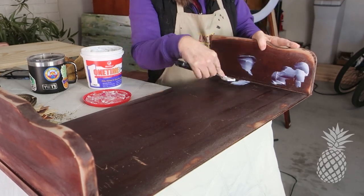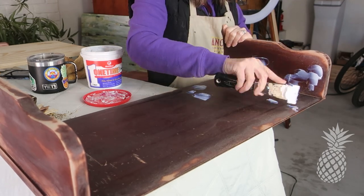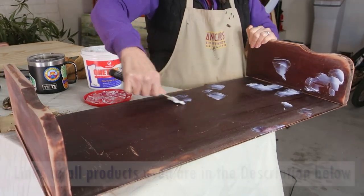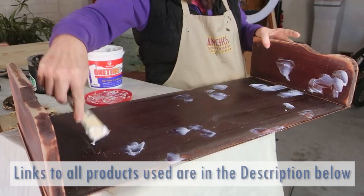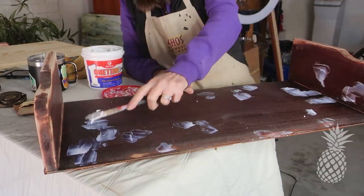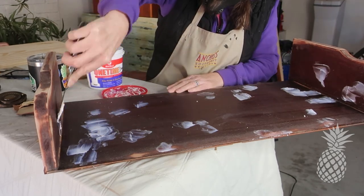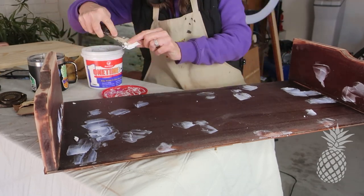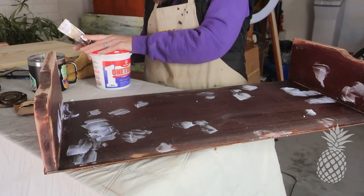You know, over the last two projects, we've discovered lightweight spackle. I'm not sure what brand this is, but it will be linked down in the description below. We just love it. This is the best stuff for those tiny little holes that you need to fill. It's just very easy to put on and it sands like a dream. Yeah, just don't use it for those big gouges because it'll crack. It's just too lightweight. You want real putty for the larger gouges.